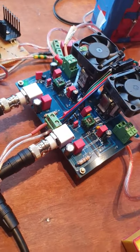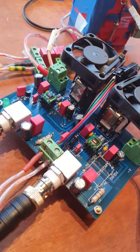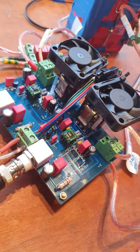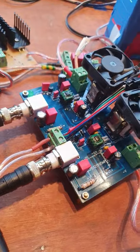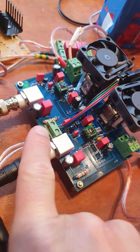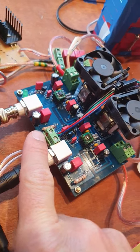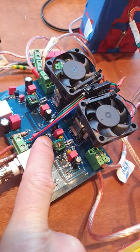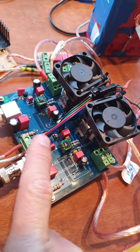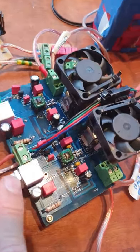This is my new PCB that switches the MOSFETs, which makes it able for me to switch 3500 volts. The previous board was destroyed because I put 31 volts on a 12-volt input, and I now have a Zener 13-volt diode to protect the circuit from overvoltage.